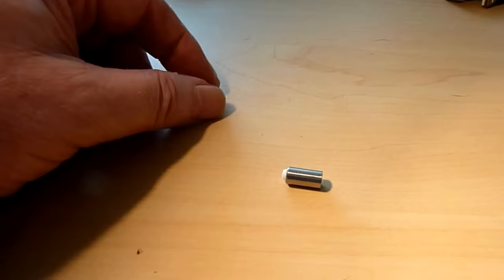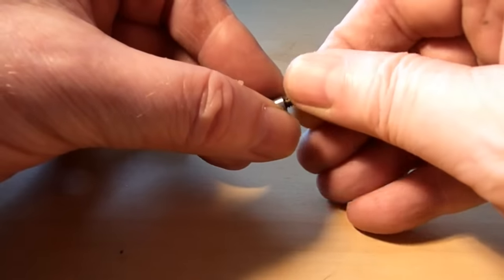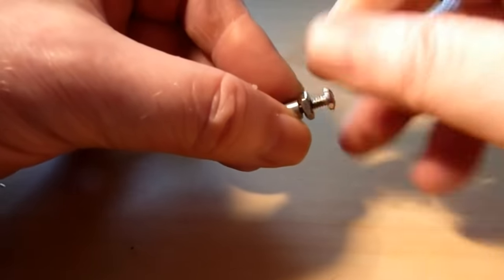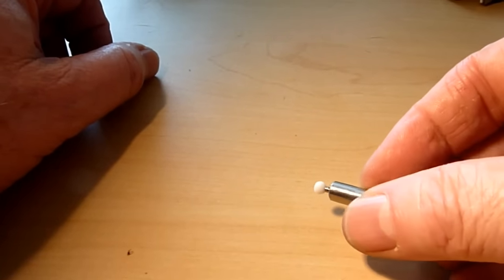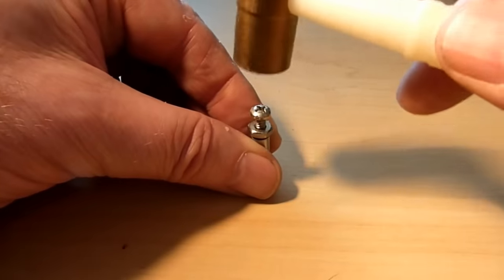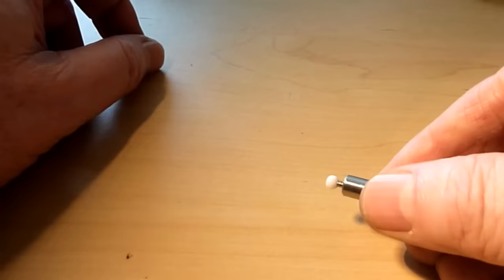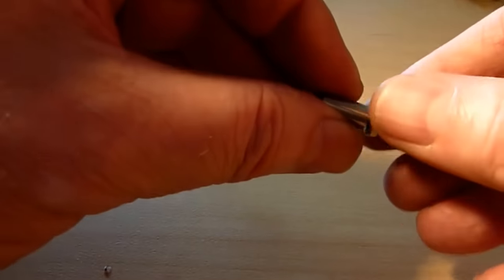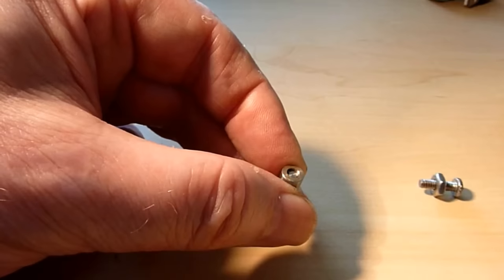Next, we need to see if the pin is seated properly. A six-thirty-second screw is inserted into the front of the valve, forcing the pin forward. You can then look at the distance between the ball and the pin — if there's any gap, a couple of taps will close it. Once completely seated, the valve is ready for testing or mounting in the cartridge. Remove the six-thirty-second screw.